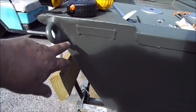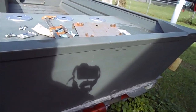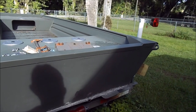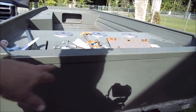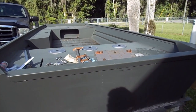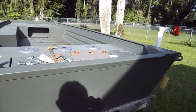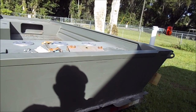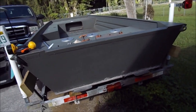I checked it out - these welds are pretty much in the same place. I measured from one eyelet all the way across to the other welded eyelet and it's just a fraction under 66 inches, which is no problem. I can go 33 inches to one side and 33 to the other, and whatever little bit is left I'll split the difference. For my purposes that's going to be spot-on.